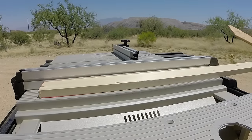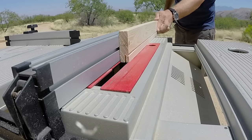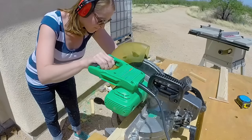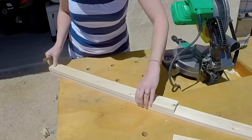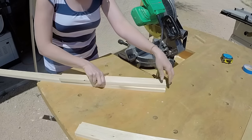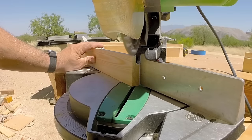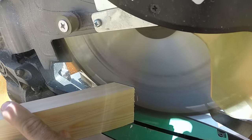One of the things my sister had wanted for this frame is to have pallet wood cladding the back side of it in a shadow box fashion. So what we're doing here is cutting out a recessed part that's going to be on the back side of the shadow box frame. In here she's cutting to length the tops and the sides of the frame and then just using one side and one top to mark the lengths for the other side and other top. After we had our lengths cut we mitered the corners and got ready to join them up.